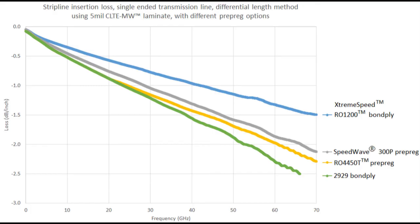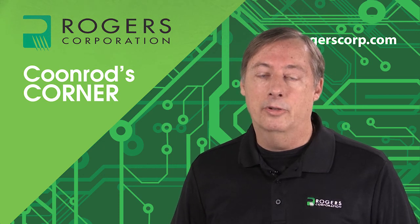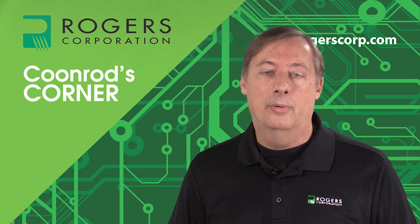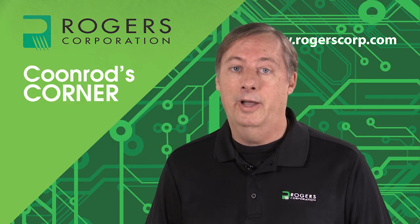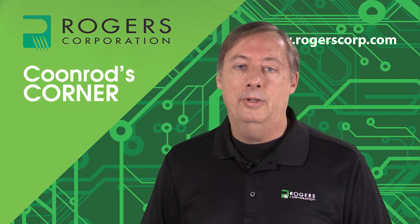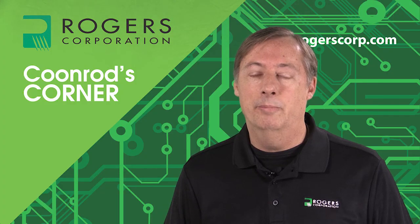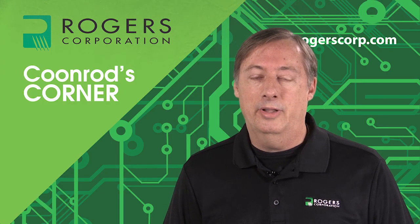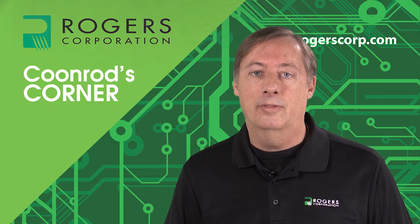You can also get an idea of how these materials do for circuit fabrication: the blue curve is a little more difficult to process, but it's also the lowest loss. In conclusion, Rogers has many different prepregs that can be used and are used at millimeter wave frequencies. These prepregs support multilayers of many layer counts and mixing of different materials in a hybrid design. When looking at millimeter wave designs, consider these different prepregs — Rogers offers many different thicknesses, allowing the RF engineer to pick and choose what they need for adjusting thicknesses at different levels of the multilayer circuit.